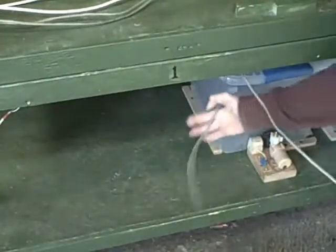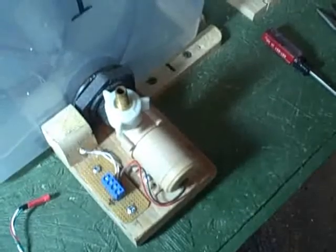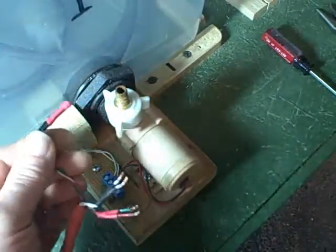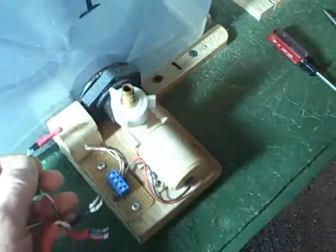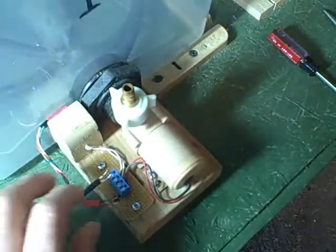The next wires we want to install are the gray wires, which will attach to our pump terminals. This is our pump right down here. We'll start with our short gray cable and connect that to our tank number one terminals. There are three groups of wires: a large bundle that goes to an LM34 sensor, which feeds the six-position temperature monitor. We want to monitor the temperature from this tank, so we'll slide this probe right in here — it presses against the side of the tank to give us the water temperature near the pump.